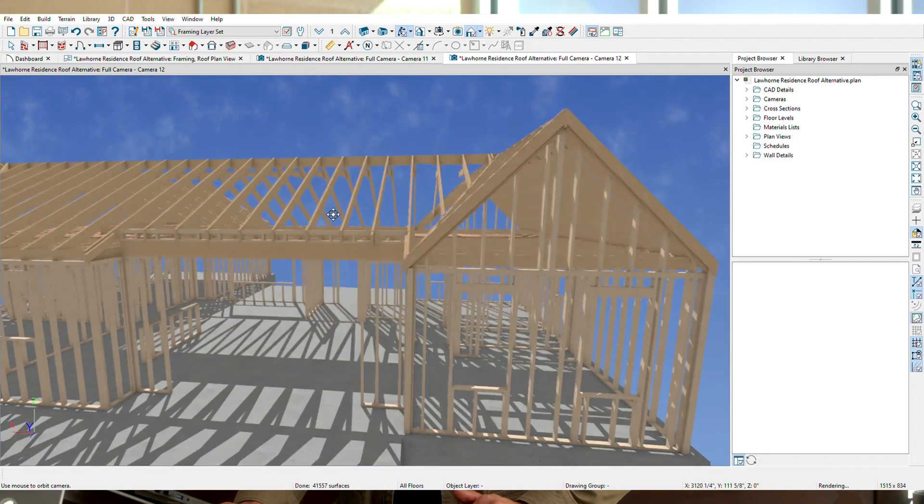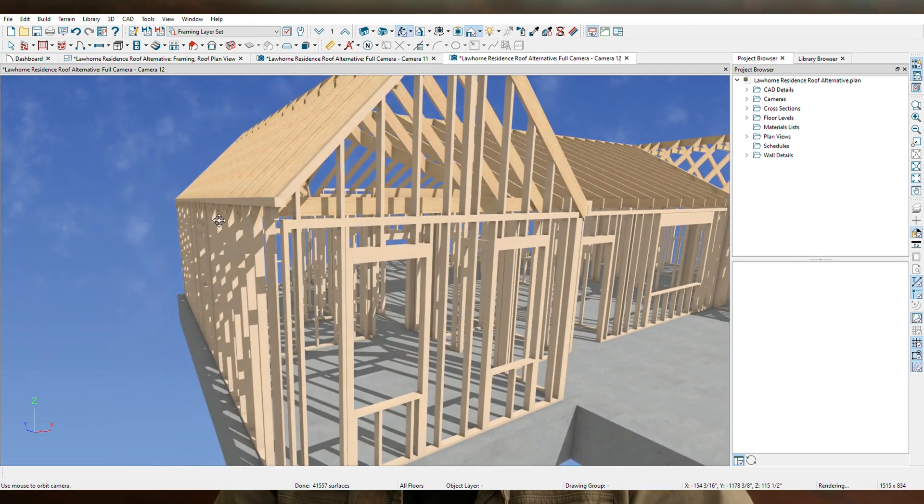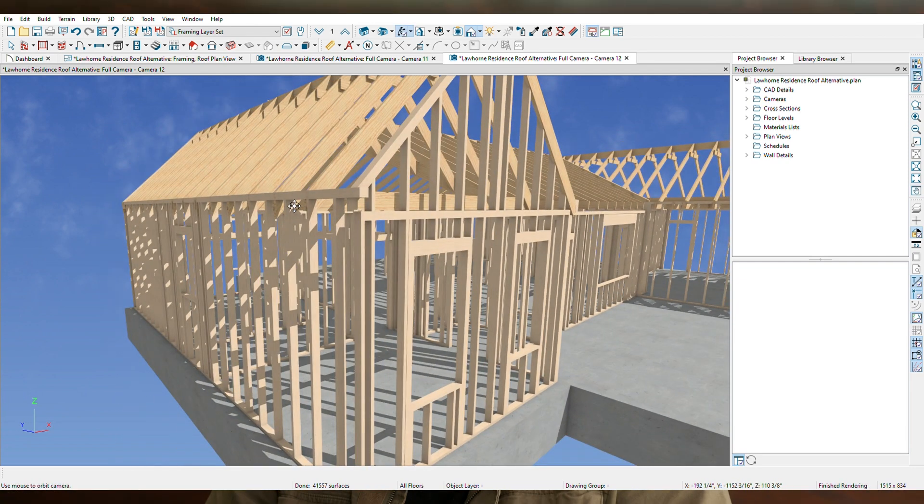What we chose to do is remove all of that soil down to three feet — whatever was on the engineering plan — and then backfill with clean soil. In this case, it was crushed fines, since we have a quarry really close, so that was the most economical material. We pulled that soil out, put in this limestone crushed fine base, then dug our beams in and put our foundation on top. This is the foundation here — underneath, we have beams cut in that give us our strength, and between those we have our crushed limestone, and on top of that a four-inch slab.